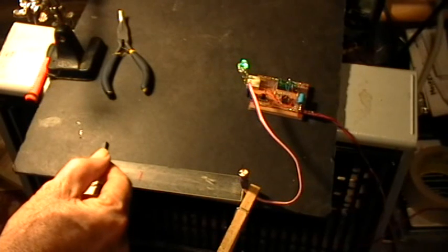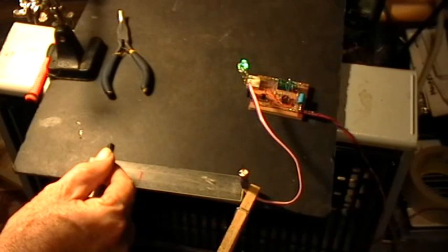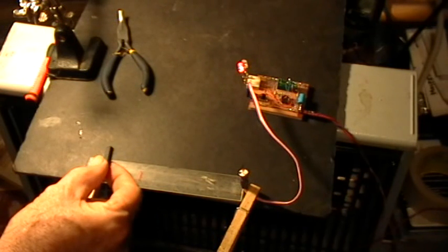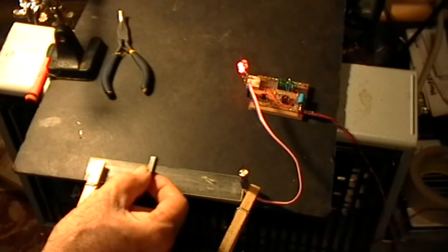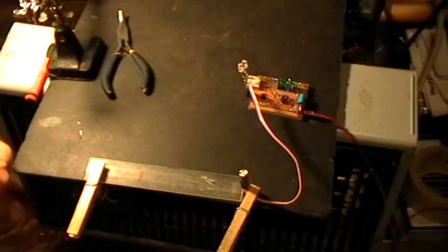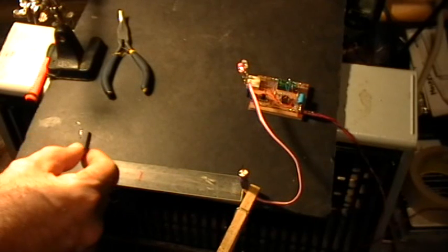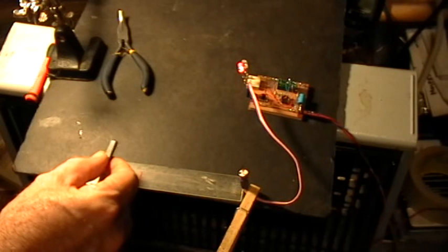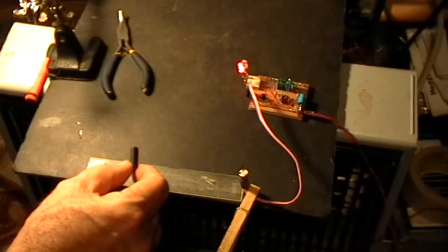Well, that's really working well now. That's almost 14 centimeters there. Of course, if you're closer, you get better switching. But it easily detects — I can see changes in the light level of that red LED from almost 20 centimeters away. You probably can't see that on the camera. But at 14 centimeters it's very clear, and at 10 centimeters you get rock-solid switching just from the field of this little ferrite magnet.